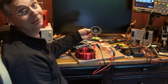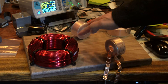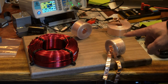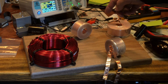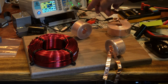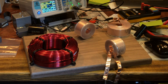Here is an example of four inductors trying to live in harmony together. We have two flat ones on the same angle — because they're on the same angle, they need to be far away from each other, in this case about seven to eight inches. The other two are at a right-angle plane: this one's plane is perpendicular to that one, and they can be as close as two to three inches. Same with this one and that one — because of the different right-angle plane, they can also be closer. Those two are about three inches apart; that's as close as you probably want to get them.